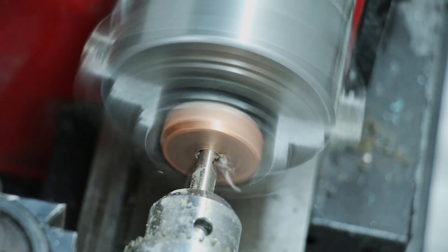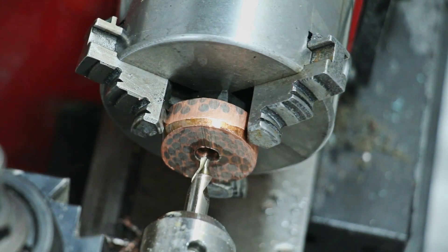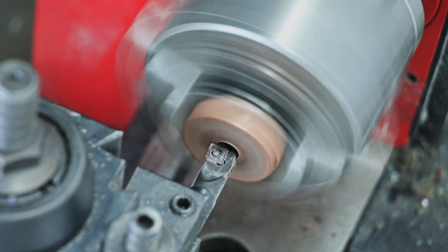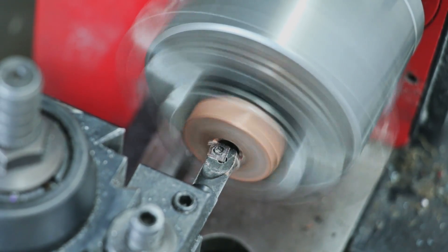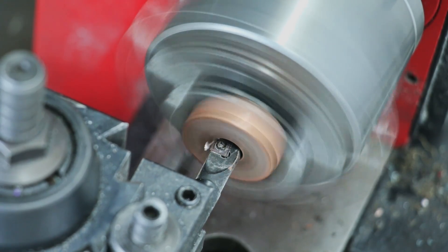The reason for doing it in that order is a little difficult to explain, but basically it makes the ring more accurate in terms of its dimensions — ring mandrels are never perfectly precise, and the lathe jaws themselves actually do a much better job at holding it.